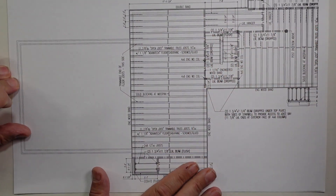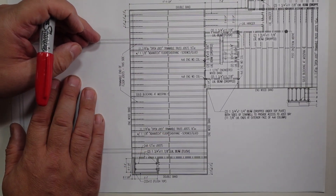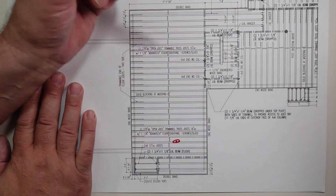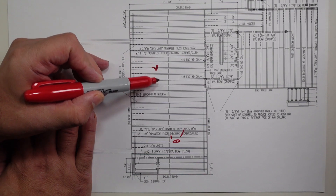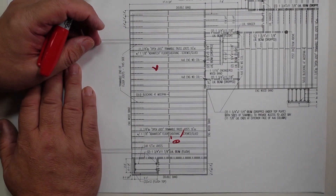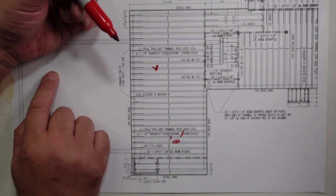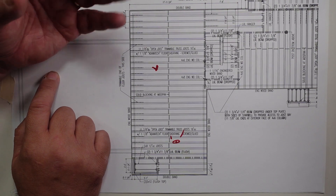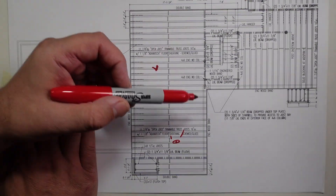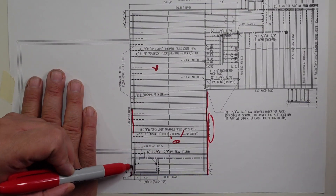You can see here I took a partial section of the floor framing — there's a whole other section of the house. If you remember in the video out at the job site, I was probably standing right about there looking here with the camera to give you a sense of where I was in that layout. We lay out an edge band here and here. The edge band is a single edge band and that is always perpendicular to the floor joists.